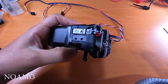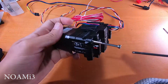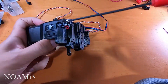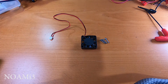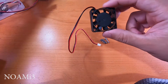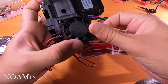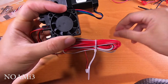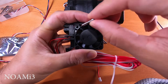For the next part you'll need a filament sensor, an M3 by 40 screw, and an M2 by 8 screw. Place the filament sensor on top of the extruder body and secure it with the M2 by 8 screw. Finish the sensor assembly by inserting the M3 by 40 screw into the extruder body to close the last gap. For the hotend fan you'll need three M3 by 14 screws. Ensure the wiring is oriented so the wire gets tucked into the channel on the extruder, then fit the screws in three spots.